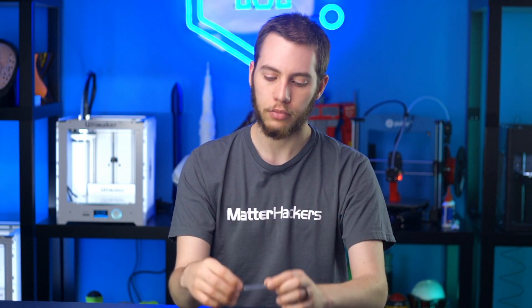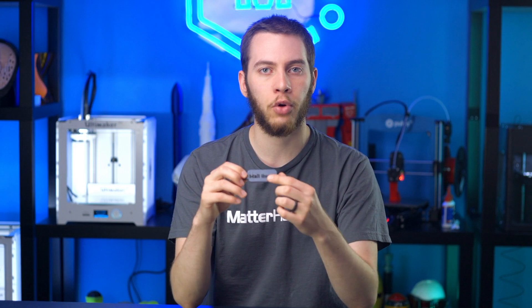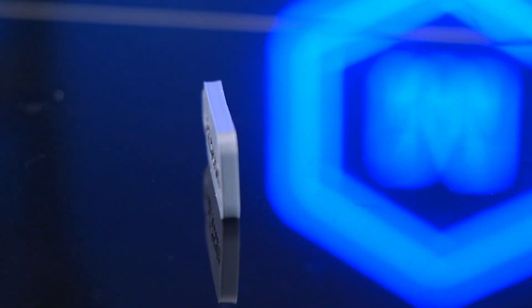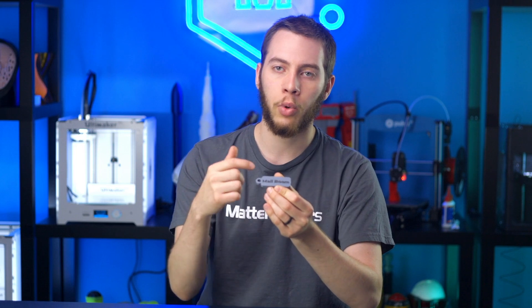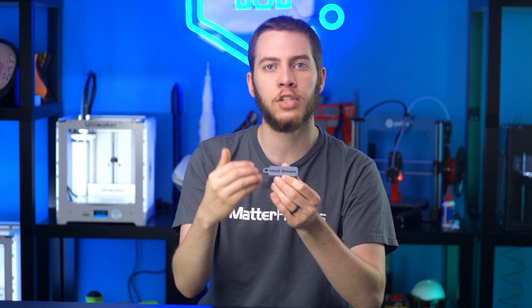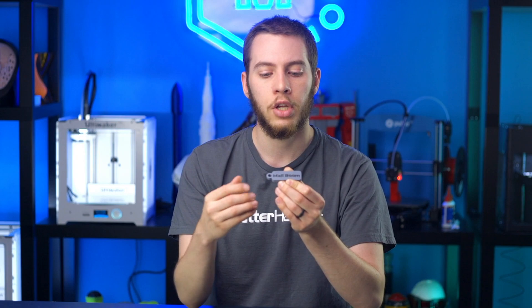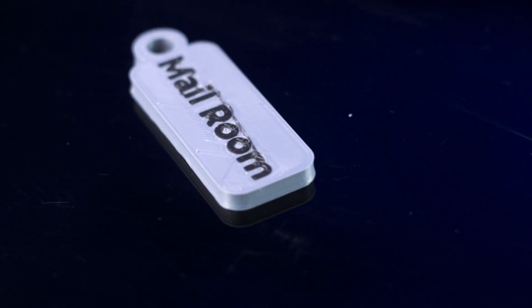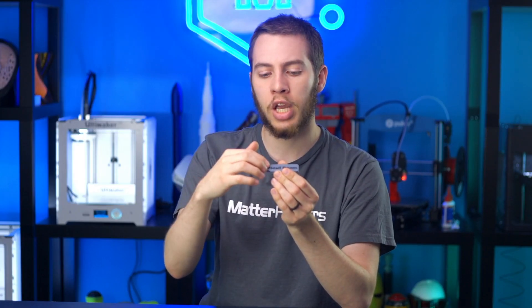Top inlay isn't something I considered until my coworker Mike showed me his version of it. I took that, ran with it and went a little bit further. Here you have a keychain that says 'mailroom' — I used the first layer inlay I just described. But on the top it also has the same print on it. To most people this would look like it was dual extruded, but what I actually did is create a cavity that's spaced specifically so it doesn't interfere with the nozzle. We print the black part, end the print, start the gray part, it prints over the top — but the cavity left here isn't a perfect shape for the letter M; it doesn't have straight walls. They're actually tapered so they don't run up against the edges of the nozzle.